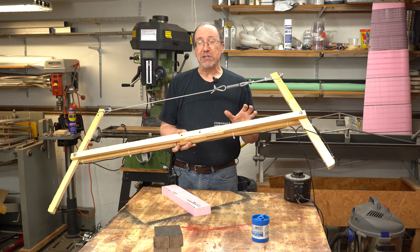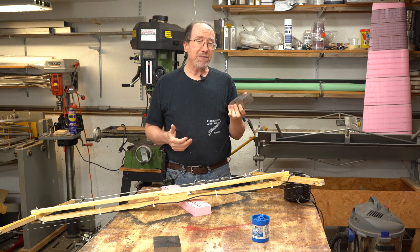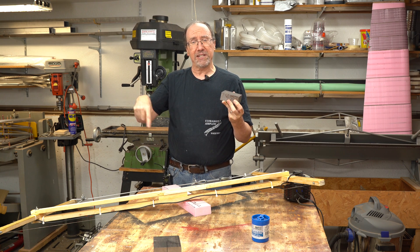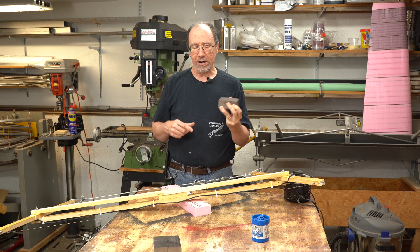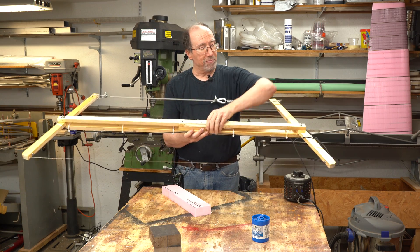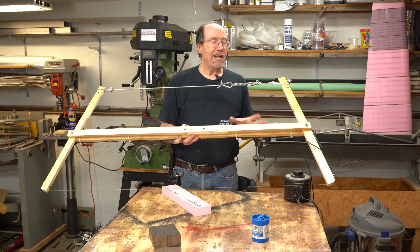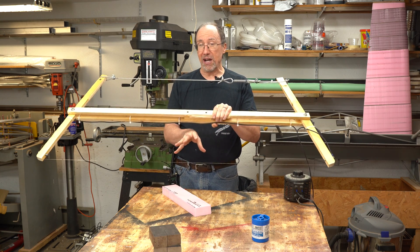About the only way to make a hot wire straight is to put tension on it. On the vertical hot wire cutter I used three five-pound blocks hung on one end of the hot wire — the other end went over an arm, went vertical down into a table, giving a constant 15 pounds of tension. I'd like to have a constant 15 pounds of tension on this bow hot wire cutter too, but it's really not practical to have 15 pounds of weight hanging off of it. There are a couple other ways to do it, and the one I chose is to use a spring.